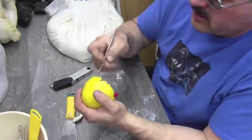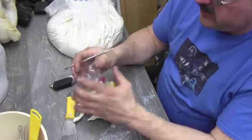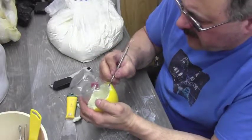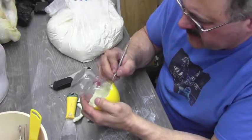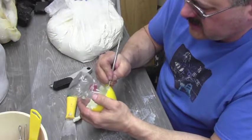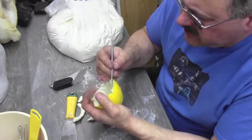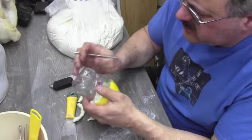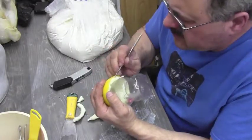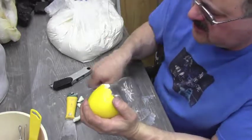Now this is just going to be a glove mold when I make the item. It'll fill from the bottom and then just pull straight over. There are not really any excessive overhangs that you can't pull with a latex mold. I might not even have to put a seam on this one. So just pull the mold straight over the top, and it should be just fine, because that's not even half an inch under there. A glove mold should be able to pull off this just fine.